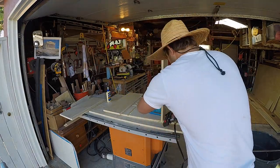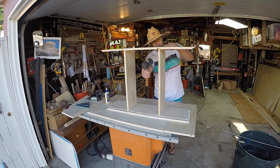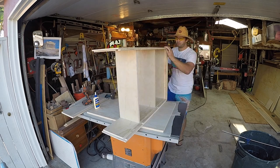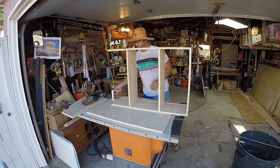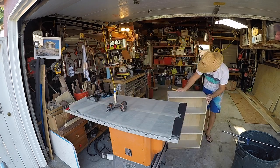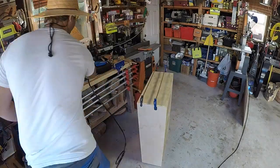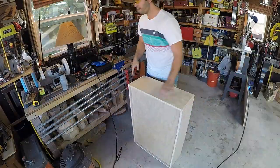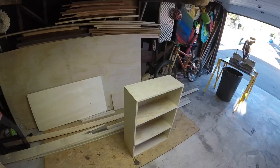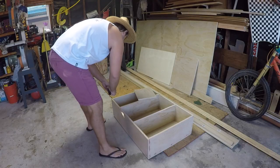It's finally time for some glue-up using Titebond 2 — getting everything hammered in place, making sure everything is square. I'm toe-nailing the two shelves and the top and bottom, and then throwing some pins at the top and bottom of the back panel as well as a few screws to keep it good and tight. This is going to be hanging from a wall and it will be heavy. That's how you build yourself a super strong carcass.